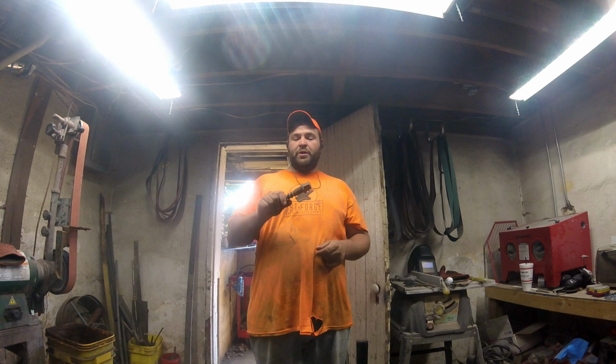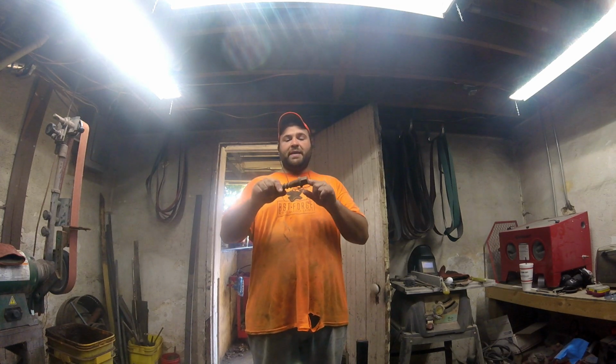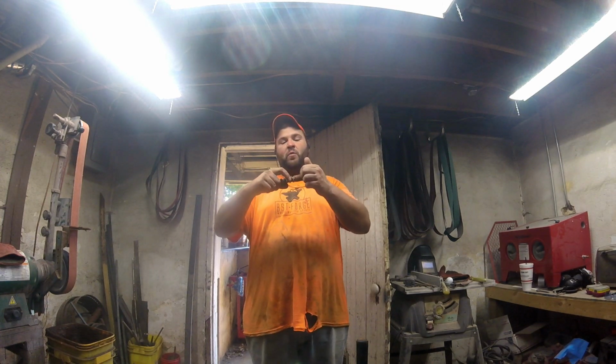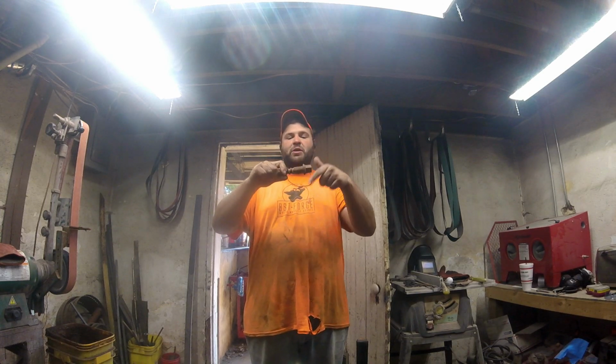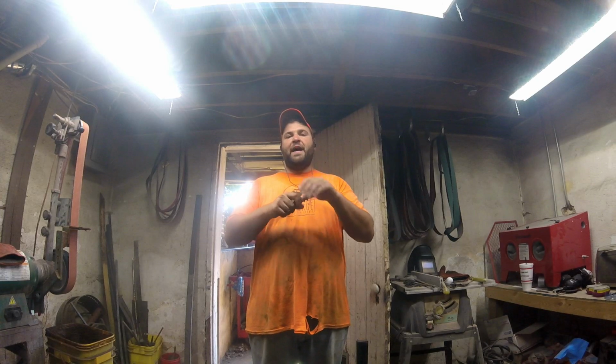So first thing we're going to do is I'm just going to take the grinder to save a little bit of time and grind this ring off. I don't want any cold shuts in it, so I'm just going to grind that off. We'll throw it into the fire, and we'll get working on what I want to make out of it.